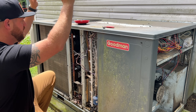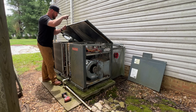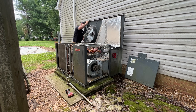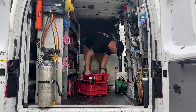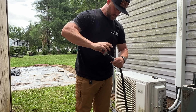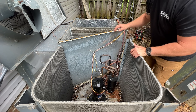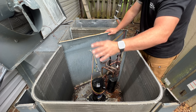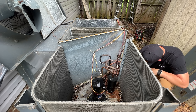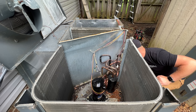Now we're ready to go ahead and remove this whole lid, get it put over on top of the flashing, and then we can inspect everything inside. The first thing I want to do is get rid of all this bulk of leaves so I can really start to clean this whole condenser section out and then start washing out this coil. A lot of this stuff you just do by hand. Thankfully on this Goodman you've got the big holes where a lot of this stuff can just get washed out with the hose.